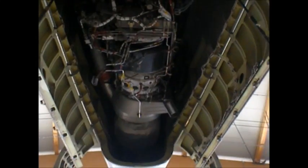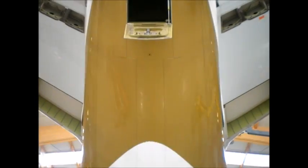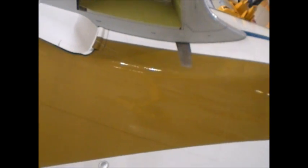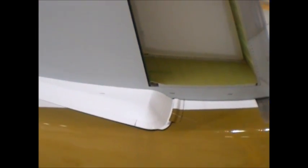The doors are open so we can inspect it. That's the entrance just forward of the horizontal stabilizer. Here's the entrance just behind the horizontal stabilizer — you can get to both sides of that center section, which is shown in another video. Panels are removed on the horizontal so we can inspect the front spar and rear spar actuators.